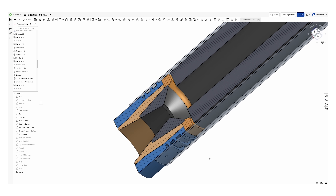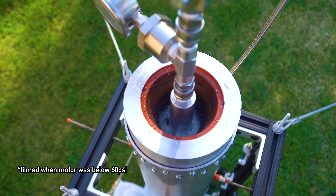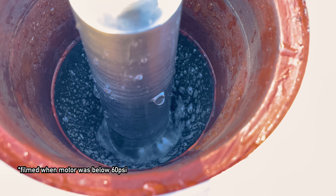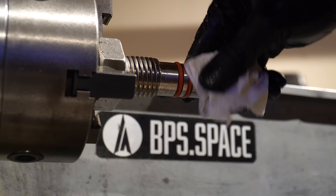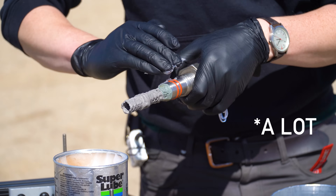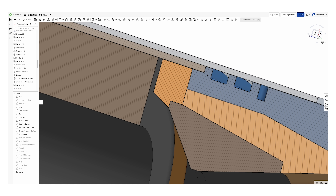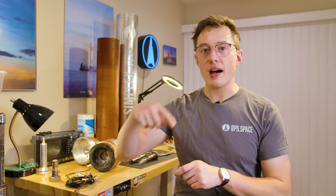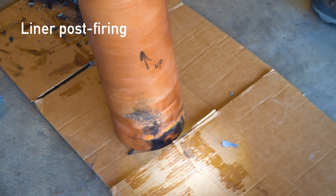This graphite nozzle had no business working at all. I cracked it because I danced on top of it, and I also put water in there during the hydrostatic tests — water can interstitiate into the graphite, and if you don't get it out, it can crack the graphite. Up at the top of the motor, this HEI design — head end ignition — was totally untested. The setup with these two O-rings means there's a solid possibility for gas between the forward closure and the HEI bolt that could burn away the O-rings. I did my best to seal it with phenolic and a little bit of grease, but that's still a point I'm worried about for the future. Back down at the nozzle, I was worried about the fit between the liner and the nozzle, which is actually supposed to be kind of loose — we don't want to seal pressure around there.